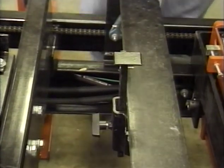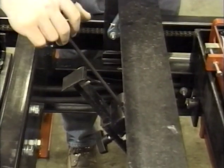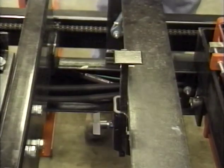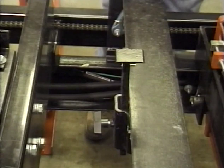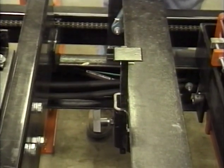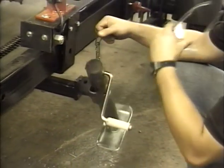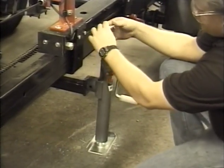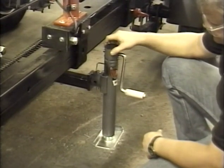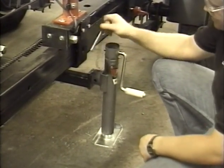There's one adjustment on the side of the dog spike that gives it enough tension to stand up when you hit the engagement lever. If it's not standing up properly, about a quarter-turn on the adjustment screw is all it takes. When pinning your leveling jacks into place, put the pin in from the top side — this provides much better stability than using the side-to-side holes.